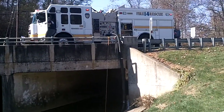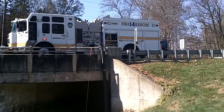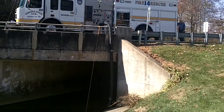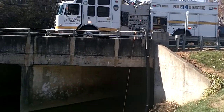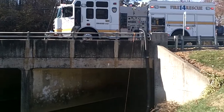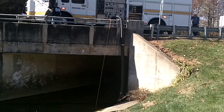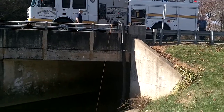He is going to engage the pump and run it up to 1,000 RPMs. It's a 1,500 gallon minute pumper using 6-inch hard sleeve. And once he hits that auto prime, we're going to start a timer and see what it takes to get this thing primed.